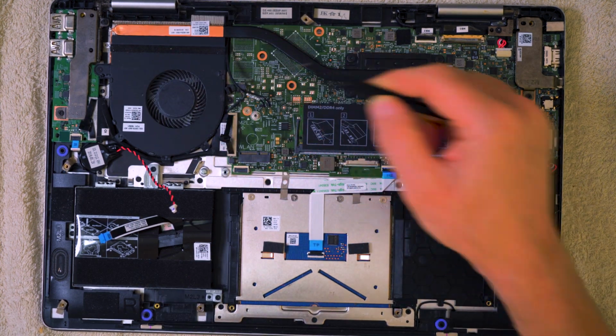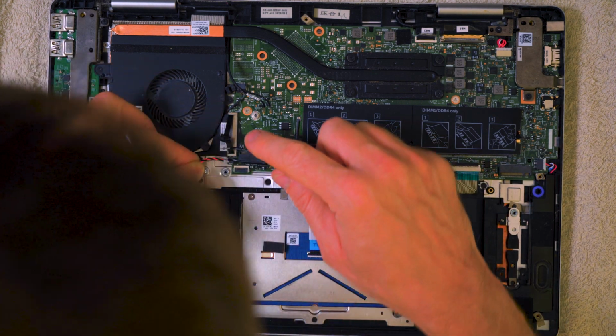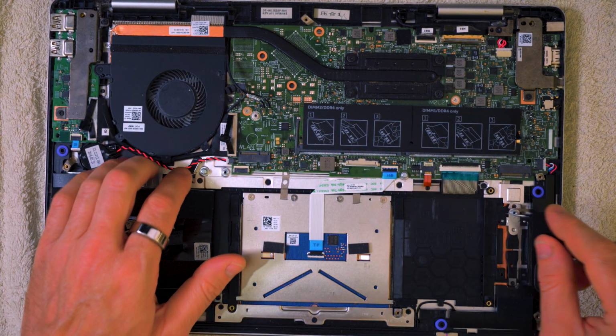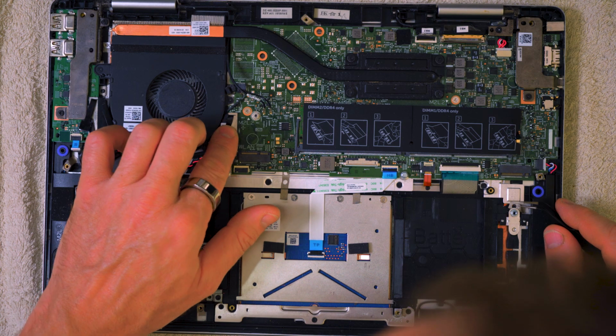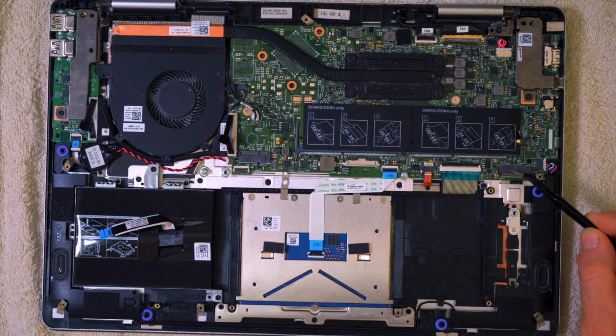So those 2 screws now in, so now we can definitely get this battery connected back. This is just for the BIOS, to make sure it doesn't lose the time and date even if the battery runs out, and other system settings in the BIOS. The one you'll notice is the time and date, so we'll have to reset that when we reboot the whole thing. Right, next I'm now going to get the hard drive in here and the Wi-Fi card in here.